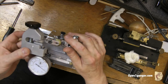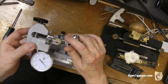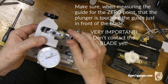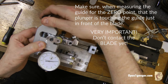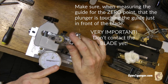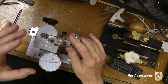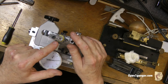Here's how it works: I'll take the plunger and push it down with the front guide, then slide the unit in so the guide is now going in between those two troughs. Then I will tighten the carriage. I just did this a second ago and it was 0 — that shows you how accurate this is. It can repeat so easily. Now I've zeroed the plunger on the guide.